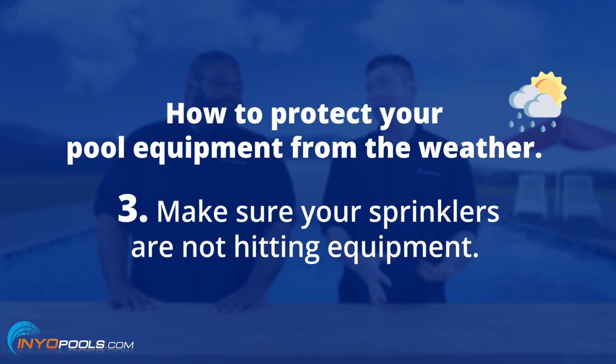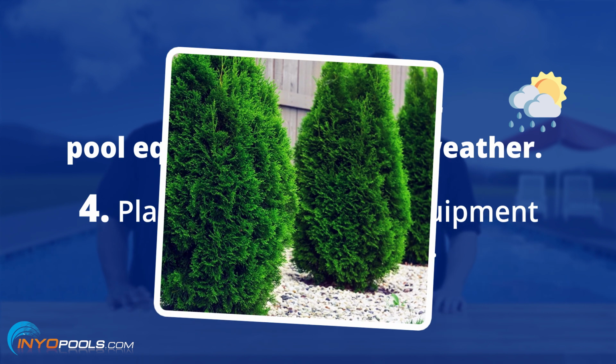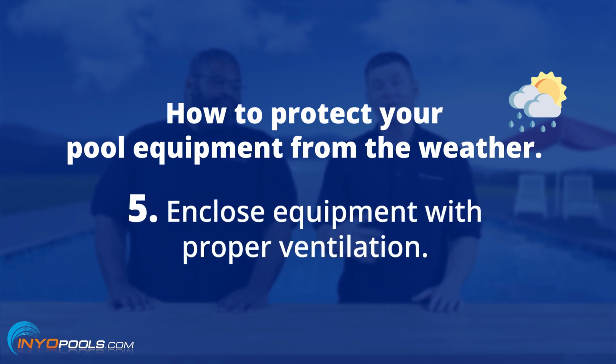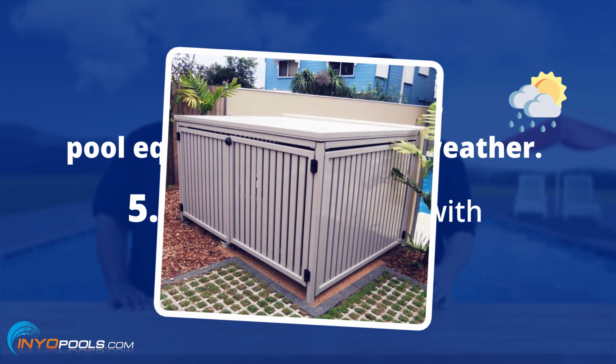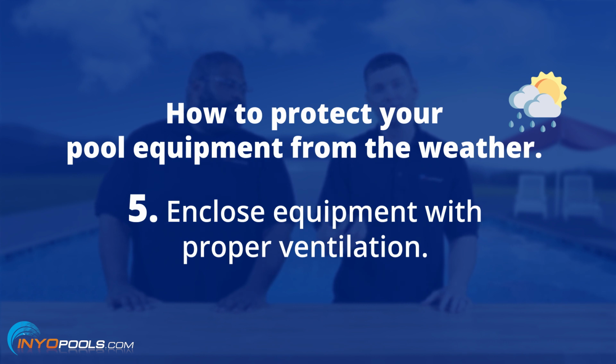We've seen sun damage in Florida where the equipment's out in the sun all the time. So what you can do is maybe plant some shrubs around your equipment to protect it from the sun. Some people I've seen enclose their equipment. If you do that, you want to make sure it's really well ventilated because the pumps' lifespan is going to be shortened if it's under heat all the time, because the bearings and the windings are only made to heat up to a certain temperature. So you want to make sure it's really well ventilated if you do build some type of enclosure around your equipment.